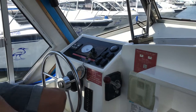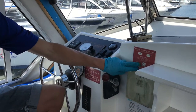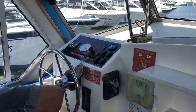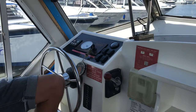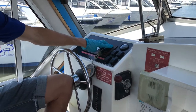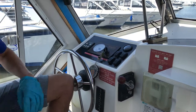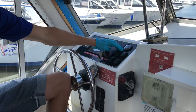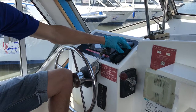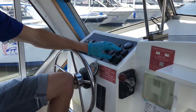At the helm of Royal you have a revometer which will tell you how fast you're going in miles per hour. At 1200 revs you're doing four miles an hour, up to six miles an hour which is 1800 revs. Beside the revometer you have your engine warning lights — if any of these come on please moor at your earliest convenience and give us a phone call. You then have a bilge pump which in this position is on automatic, a water pump for pressurizing your taps, a windscreen wiper, and a horn.